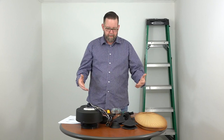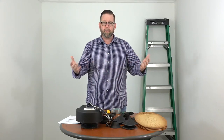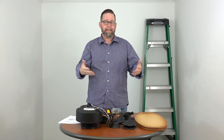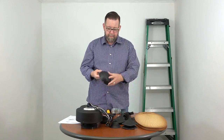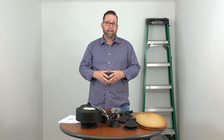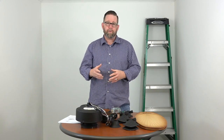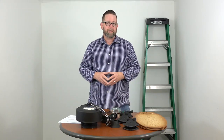A couple of notes about the fan: it is an indoor/outdoor fan, wet rated, so you can hang it on an open pergola or similar — it can get totally wet without any issues. The ceiling fan is also light kit adaptable — just pop out the center plug, put your light kit on, and wire it up. If you're installing this fan with a light kit outdoors, make sure that light kit is rated for outdoor use, either wet or damp rated depending on your installation. If installing indoors, it's compatible with any universal ceiling fan light kit.